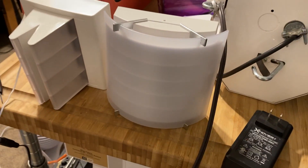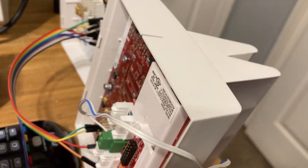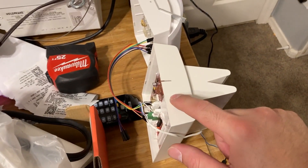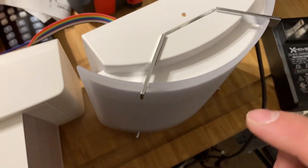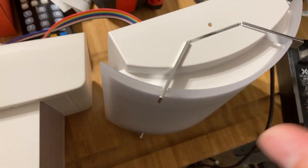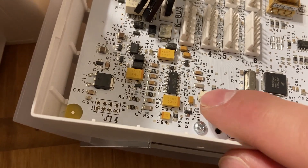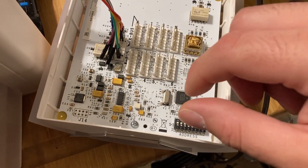This other type of light I'm not sure is from the same system - I have no idea, I'd never messed with hospital stuff before. This one is completely different; it's got that 8-pin connector. What I did was take the 18 volts that this board provides as a secondary output voltage to power it. Before this, the thing wouldn't really do anything except have a little flashing red LED light in the back. I flipped all the address switches - yes, these are addressable.